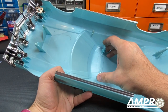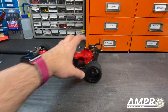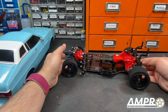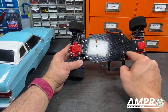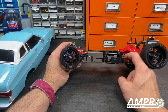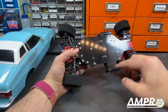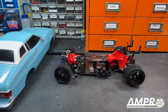I'm not going to use the stock body mounts. Because the body will be screwed in place, I want the battery accessible from the bottom side. I'm really happy it came with this upgraded chassis — it's a nice flat surface which gives me excellent datums to pick off all the mounting points. I can figure out the Z height everywhere on this car by measuring from the bottom of this to the top of these plates. This will be a bathtub style at the front and a reverse bathtub at the battery.